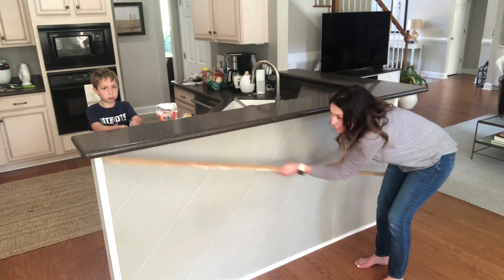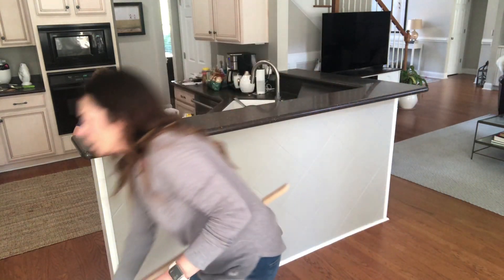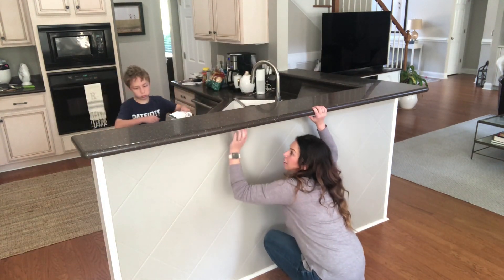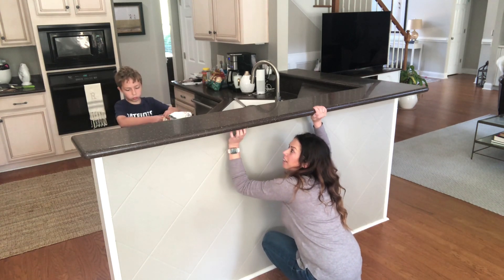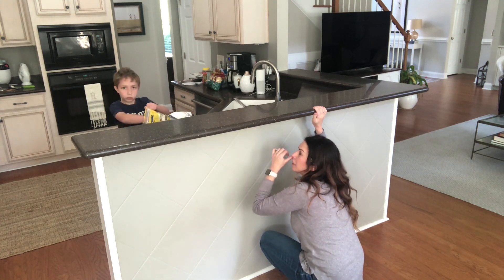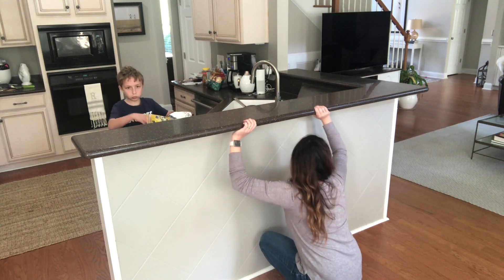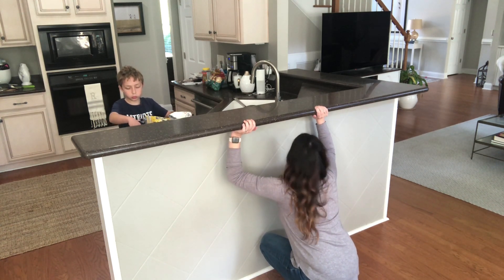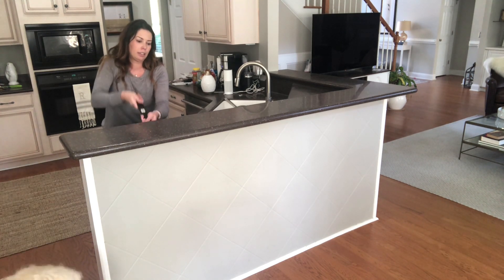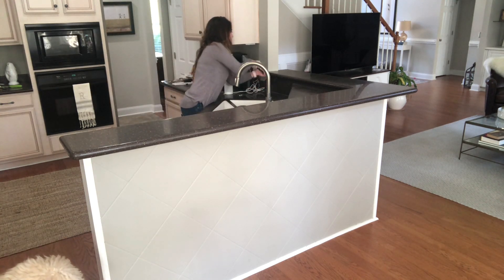I just got this little stick to come out from underneath the counter. I can see it was just kind of a spacer, and there's another piece of wood right here, so I think this whole piece of wood is going to have to come off. I can see the underlying lip of the Corian, so I'm taking the crowbar and wedging it underneath, just trying to loosen the counter a bit — and that's helping a lot.